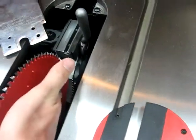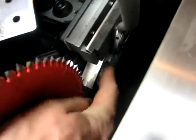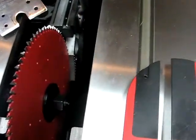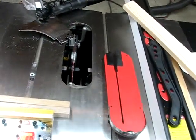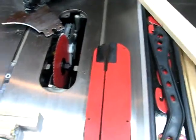I just got this out of the box. Whenever you change blades on this saw, you have to adjust the brake cartridge. This yellow screw here adjusts the distance of the brake cartridge to the blade, and you want to make sure that distance stays about 1/16th of an inch. When I bought the saw, they had a box of trashed brake cartridges and blades where people had switched blades out and not paid attention to the clearance. So that's one thing you have to pay attention to on this particular table saw.